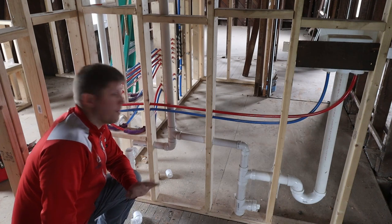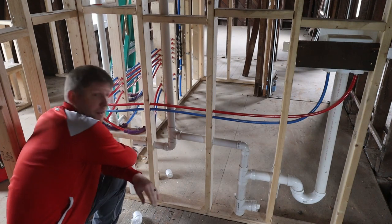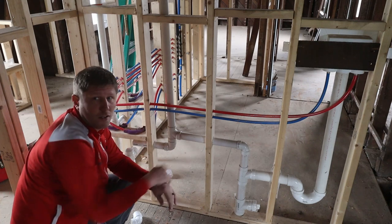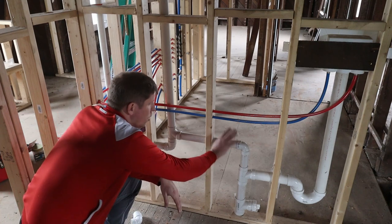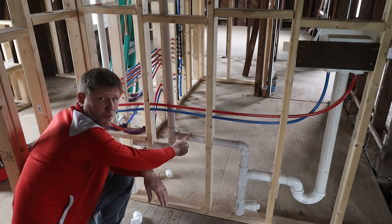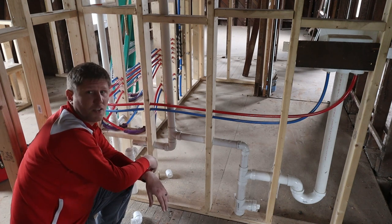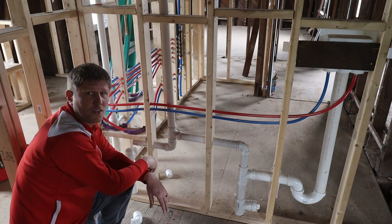The same thing has to happen here on this side. Another sink from the laundry room and the water coming over from the washing machine. We have to move these two horizontal vent stacks a little further up because otherwise they could get clogged.